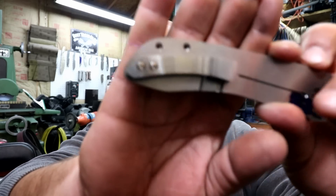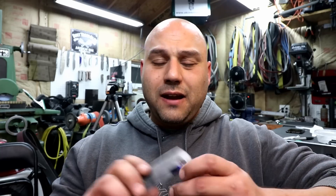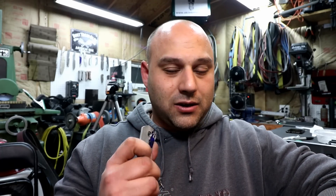Alright guys, that looks like it's going to do it for this episode. We successfully installed the pocket clip — we didn't mill it yet but we'll get to that in the next episode. It's a little detailed and you have to get the measurements just right to get that nice spring action. After that we'll cover how to chamfer or contour the handles. We also installed the detent. If your detent's a little light there are a few tricks to tune it and get better action out of it. If it's a crazy heavy finger-breaker, that one's a little tougher to rectify but we'll dive into it. That'll do it for this episode — I'll catch you guys on the next video.